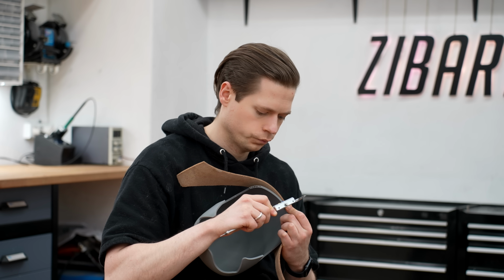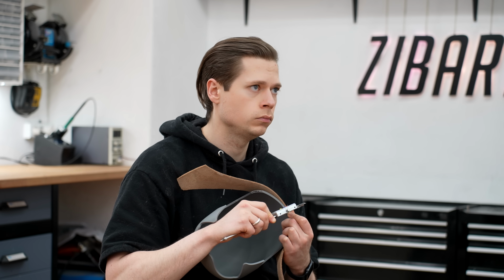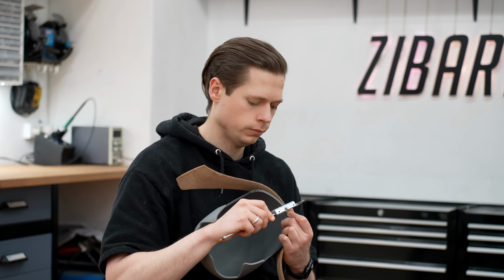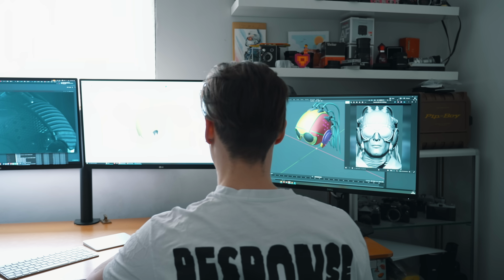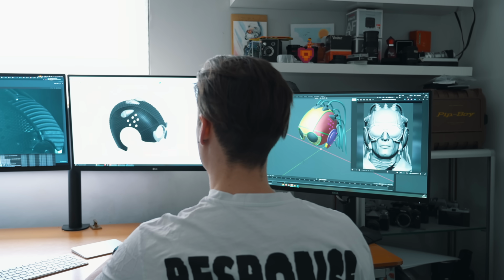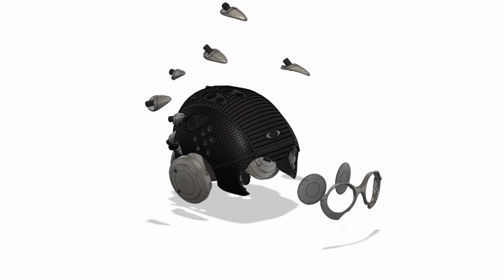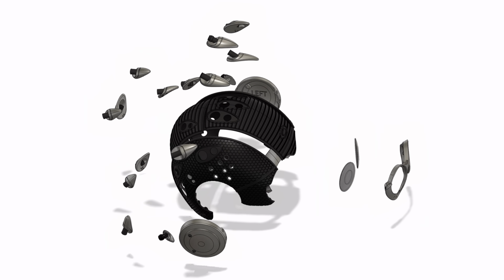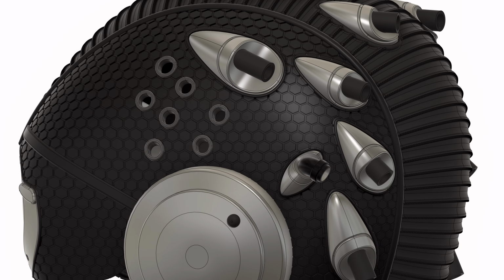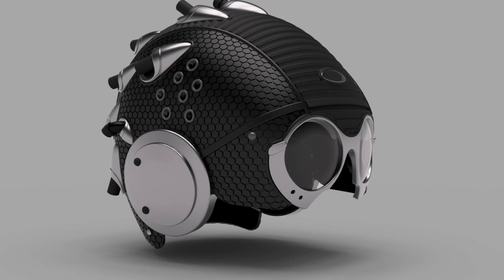Stacking more layers or using some sort of a shell underneath would just defeat the purpose, so I just need to cut my losses. As I see it, my only shot in nailing both the sleek proportions and the details is resin printing. With no time to spare, I requested all the files they have and spent the next couple of weeks modeling. The upside of resin printing is the precision, but the downside is that it's only as precise as you make it. I modeled in hundreds of these hexagons and thousands of these stitches just to make it extra real when you look up close.